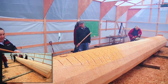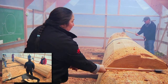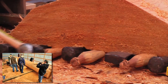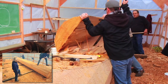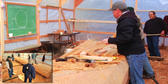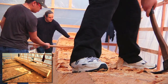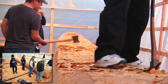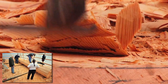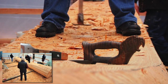Next, cross-cuts are made down to the scribed gunnel line, and axes are used to remove the material between saw cuts. If possible, the center portion of the log can be saved for later repairs or other projects, as it may be a fair amount of material. For more control in removing material down to the scribe lines, ship adzes are used. It is important to make the gunnel line's surface fairly flat across the width of the canoe, as measuring templates will be used as a base.